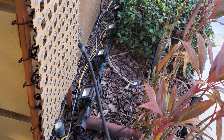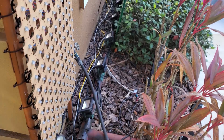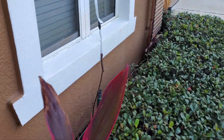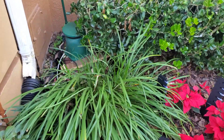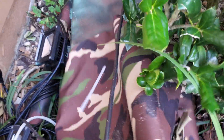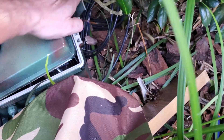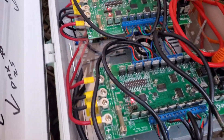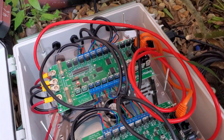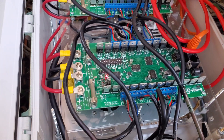As far as floods — there are seven back there, these are old Light-O-Rama dumb ones. We're running these all off of Pis. This is what we call the pie box — there's one on both sides of the house. These are Light-O-Rama boards — CMD24Ds, I think there are two of those in there — and then on the bottom deck there's an FPP and Raspberry Pi running these, so it's all DMX basically. Chaining these boards can put out 24 DMX ports.